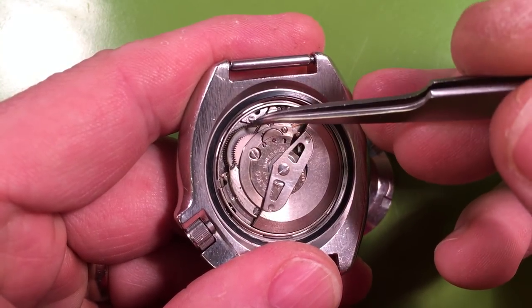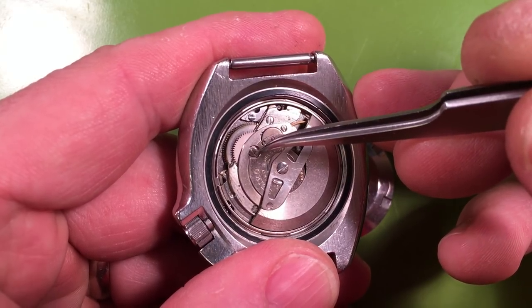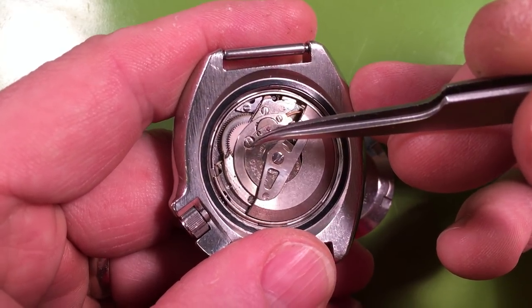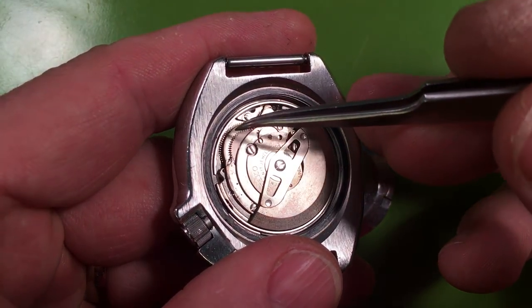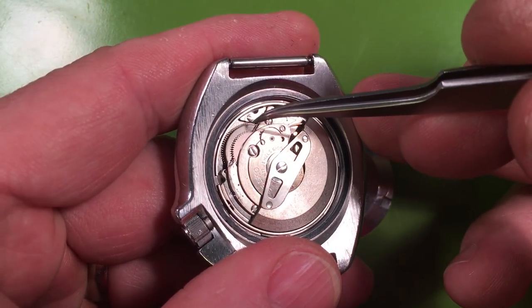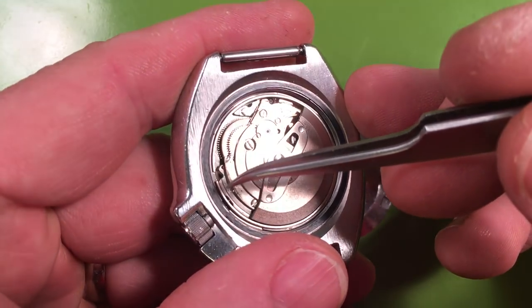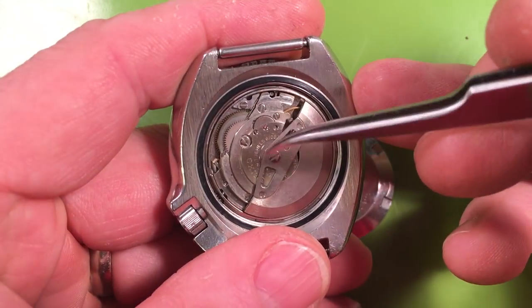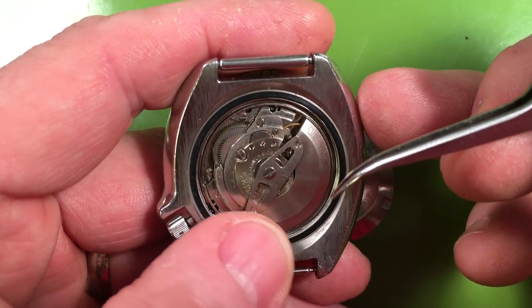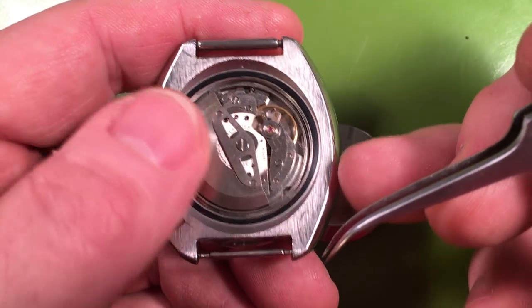If you watch this screw head, see that movement? So I'm going to have to repair the lower end of this thing. We're going to have to machine that out and put it in a jewel. It's so worn that the whole barrel is tipping over and this edge is grinding against the underneath of the bridge, and that's a problem. You can see the wear too here from this winding bridge. So we've got at least a couple parts that are going to have to be replaced in a fairly major repair.